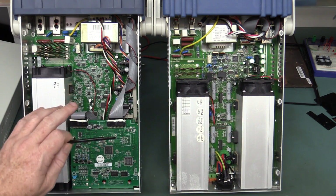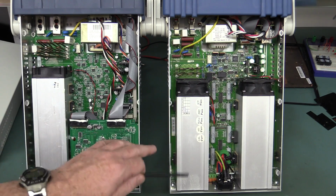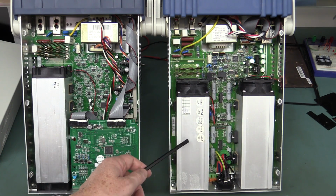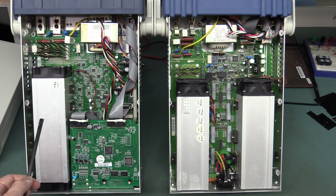The 8500 series and the new 8600 series, it's very similar to before. Obviously, they've shared a lot of stuff in here, and the physical differences are going to change depending on the model you select. So this one here was a 300 watt model, and they used two separate heat sinks here, a total of 8 power transistors. Sorry, this one is a 250 watt model, single heatsink. It's got 10 power transistors in it. I'll show you up close very shortly.